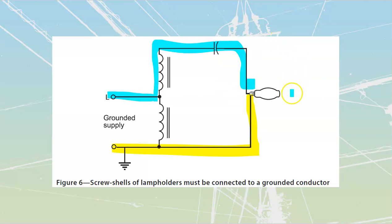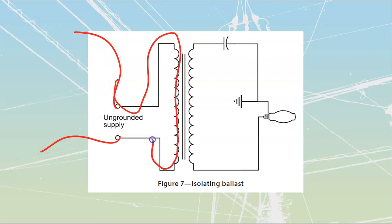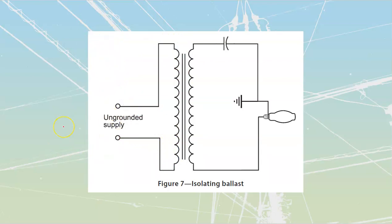In cases where we have auto transformers like this, we're going to have a direct connection through. In some cases, we're going to have isolation types of transformers. Once again, these are better suited to massive dips because we've got more inductors in there, which are able to collapse some of their magnetic fields to supply that lacking current. So we like these on disruptive types of systems, as well as on our series lighting applications, right? Because we can series out another couple of these, and all of my current would only be traveling through that primary winding.